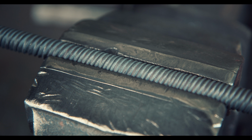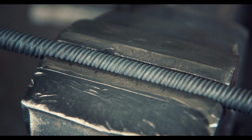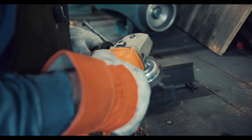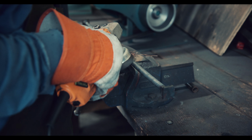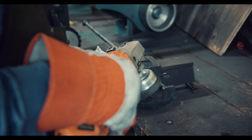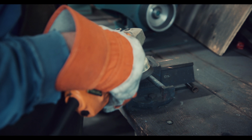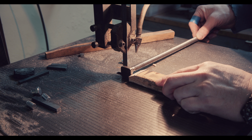Before I do that, let's take a closer look at the twists, and here you can also see how the chamfer helps relieving some of the stress. Without it, the raised twists will be much thinner. A wire brush on an angle grinder easily gets to all the recessed places, and the result is a clean and shiny bar that just screams to be forge-welded again.